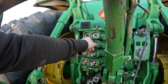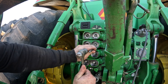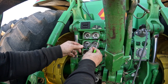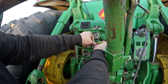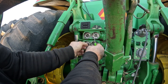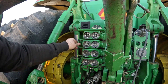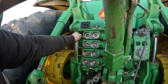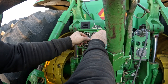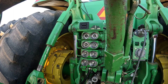I'll show you — you can see it right in there, then take my finger and push it up in the groove. We'll take our new coupler and slide it in. It'll go to a point where it wants to stop — push it a little ways. The outer ring around it you have to take a hammer and a small punch and tap it in there. Once you've got that in, you're ready to put your snap rings back in. Always get one corner started and work your way around. Make sure it doesn't want to pop back out — gotta get that snap ring rolled back in there. There we go, now it's in there good. We'll go ahead and put our covers back on, then hook our gauges back up and retest.